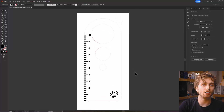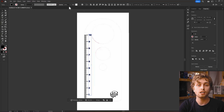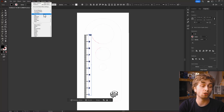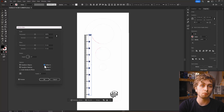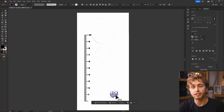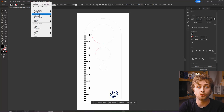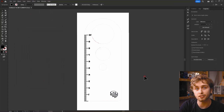Our design's looking great so far. We have a couple of etches, and if these are on the top face they can get contaminated really easily. Generally, etches on the bottom side will remain cleaner for much longer. We could wait until our design's complete and mirror all of it, but we'll get ahead of that and do it now. The text and logo will look backwards if they aren't mirrored — and coincidentally this will put our ruler on the right hand side, though it can be mirrored easily for left-handed makers.